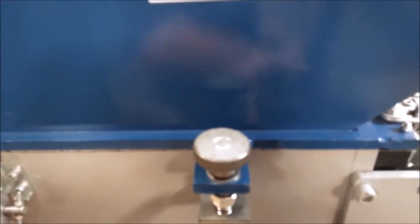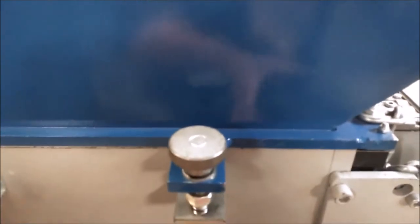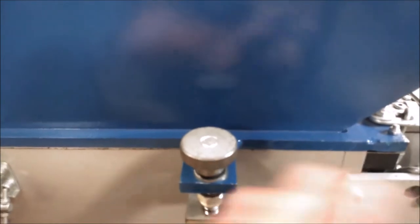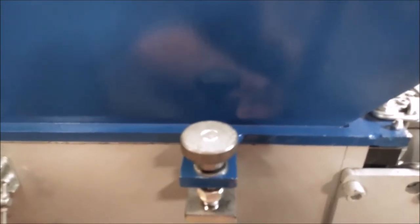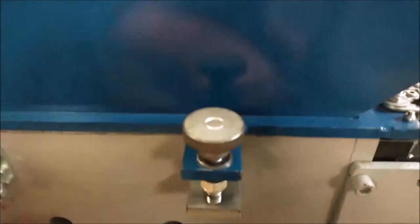It's really good for consolidating space, because the weight really isn't a factor when a semi truck is pulling a trailer load of this stuff. And if you want to reuse it in the next shot producing plastic parts — if you're set up for that — it's got to be ground up in order to go down into the barrel of the injection molding machine and be melted to go into the mold to form the part. You can't just throw big runners in there and expect them to break down and melt.